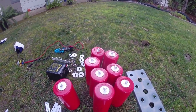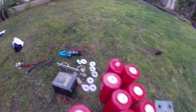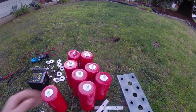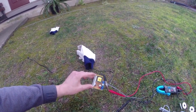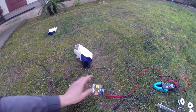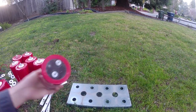We're gonna put all of these capacitors on this little metal plate with the screws over here, and then we're gonna connect them in parallel using these aluminum rods. To charge the entire thing I'm using a four-dollar 350-volt eBay step-up converter — I'll put this in the description.